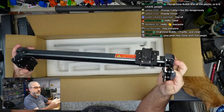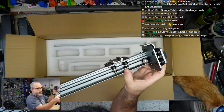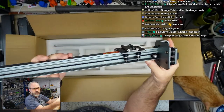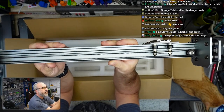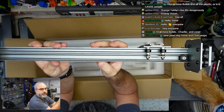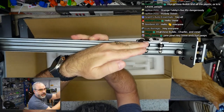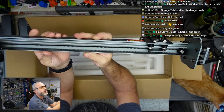It has V-slot wheels — the larger ones like an Ender-3 on the Y-axis, and the smaller ones on the X. Something I noticed on the Aufero laser I have is that all the belts are not parallel to each other — where they attach on the other laser they come in at an angle. This one looks to be nice and parallel, which is good.